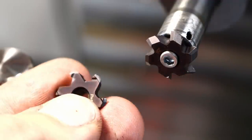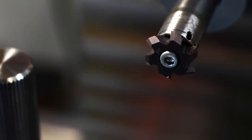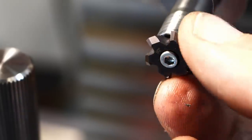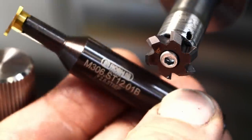They all have in common that they are absolutely proprietary and not compatible with each other. They are very expensive, but usually work very well. You can get all kinds of cutting head shapes — here is a 90-degree V-groove cutter and a 1.5mm pitch thread milling head. The shank of this one is slightly damaged and I had to do some polishing on the polygon shape inside to get it working again.